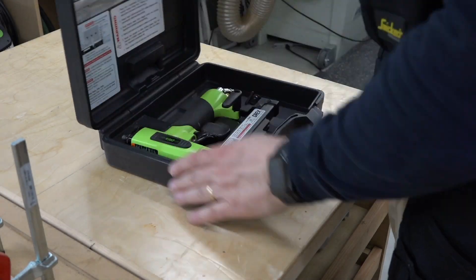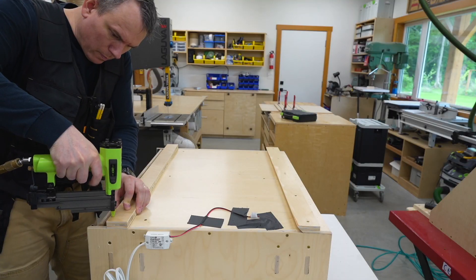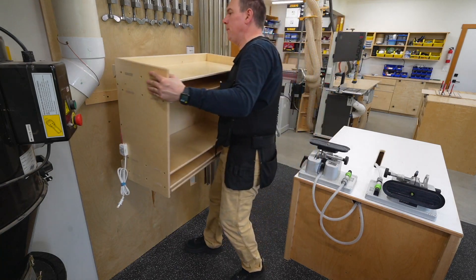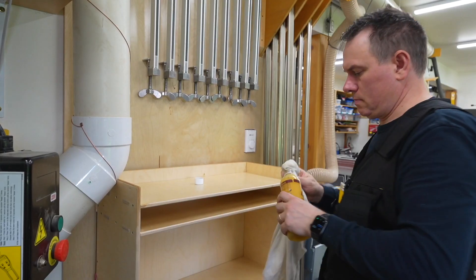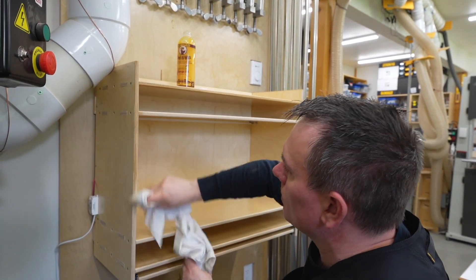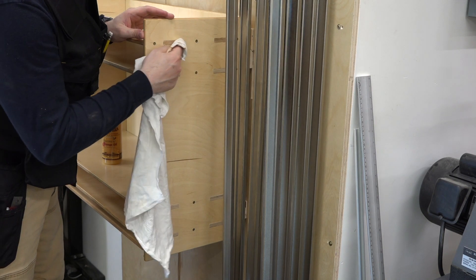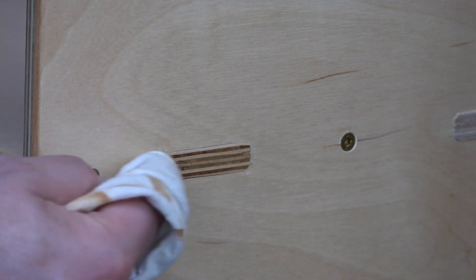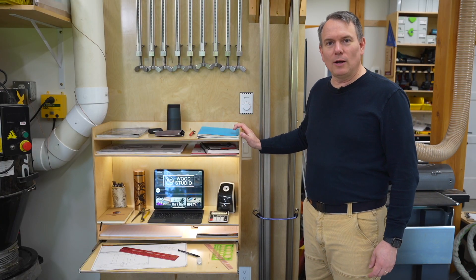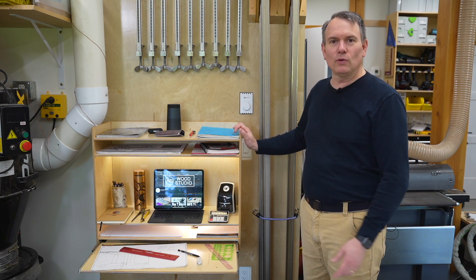I'm using my 23 gauge brad nailer to add a spacer strip to the back so the desk will rest level. It doesn't bear any weight so brads are sufficient to keep it in place. I'm using this feed and wax beeswax orange oil by Howard — it's an all natural product that really brings out the grain. It smells great and leaves a matte finish. The sander scratched some of the pre-finished surfaces and the wax made the scratches disappear. I'm super happy I finally got around to finishing this workshop desk and with the French cleat system it's really handy — you can mount it on any wall in your shop and it'll always keep the floor clear.